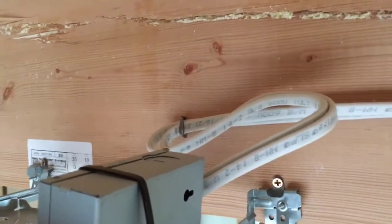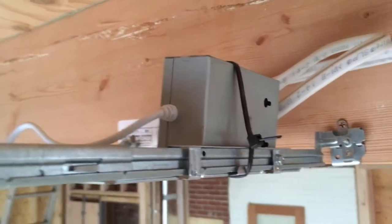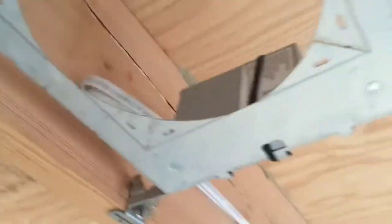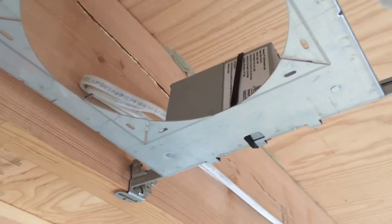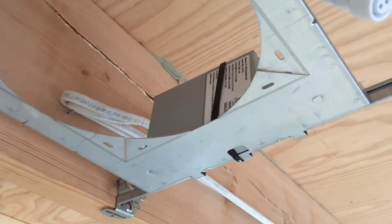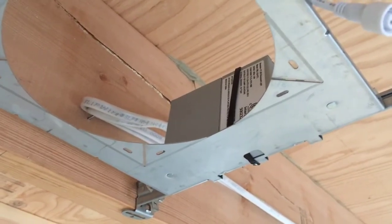Here are a few more details. You can see we've stapled the wire with a bit of slack. The reason we've done this is if the control box — which is zip tied onto the overall housing — ever dies, you're going to want to get it out through this hole. So leave yourself a bit of Romex. We find it's best to fasten the box just to keep them out of the way of the drywall roto zip, so we knew where they were.